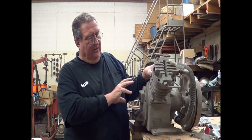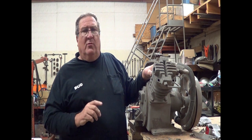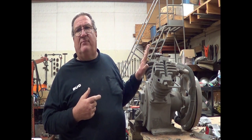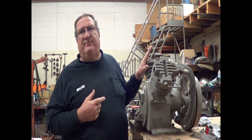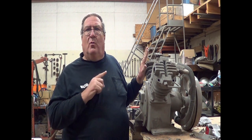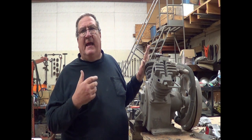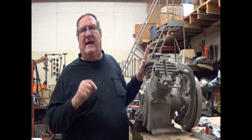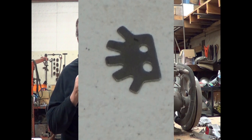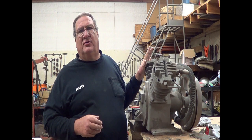So the new ones actually start easier than the 24-20, and the old ones started easier than the 24-20 too. I'm not sure of all the other differences or whether this takes a different ring set — I didn't look at part numbers — but one thing I did find out is that the high-pressure valve plate is the same valve plate used in the 24-75. On the 24-20 and the 24-75, they are using the same high-pressure valve plate. When we tore this apart, it was OEM, about 20 years old or maybe older, and it had never been apart. It did not have the extra piece of hardware shown on screen now on the exhaust or discharge side of the valves. There is more hardware in the heads to make the valves work better on the 24-75.